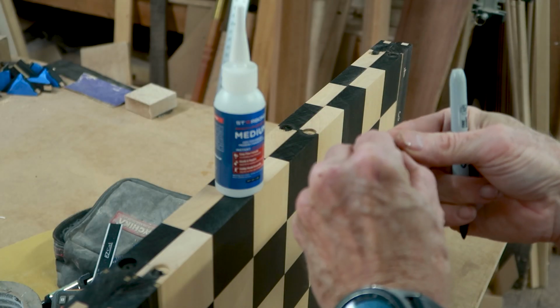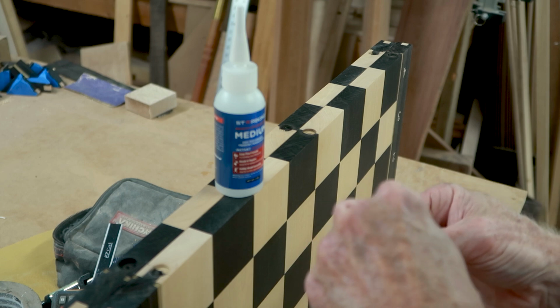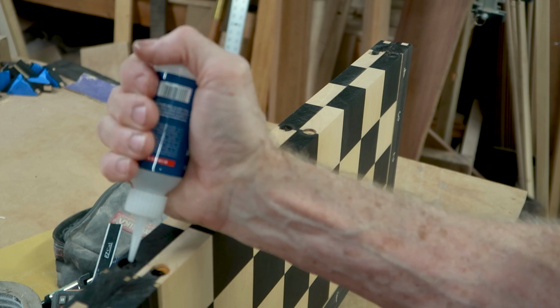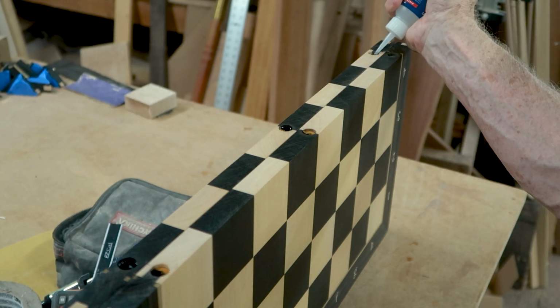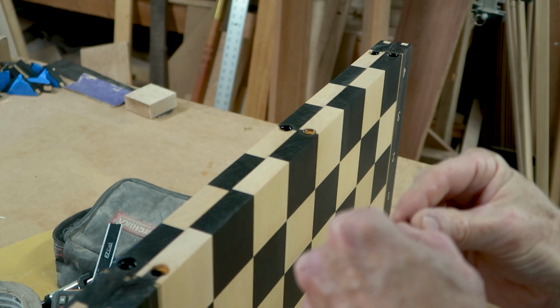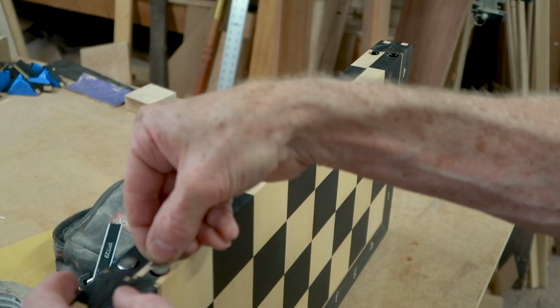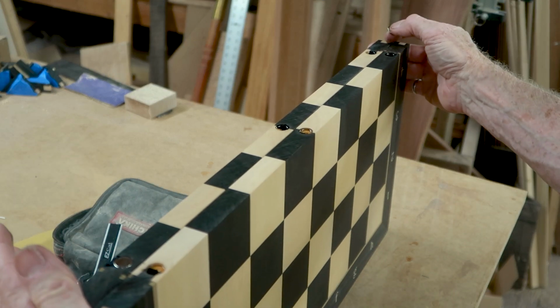I had to be sure that I didn't mess up the polarity of the magnets, so I put a black dot on the two outer sides, and then I placed the black dot down into the hole. I used Starbond medium thickness CA glue for the magnets. I'm glad I marked the magnets with the dot because the first pair attracted to each other and they jumped out. To prevent that, I slid one side to the right so that the magnets would not be directly beside each other.